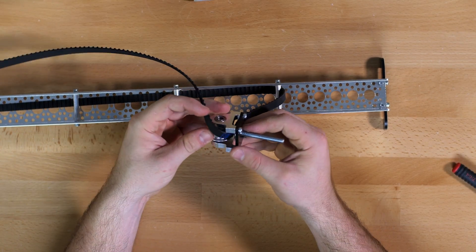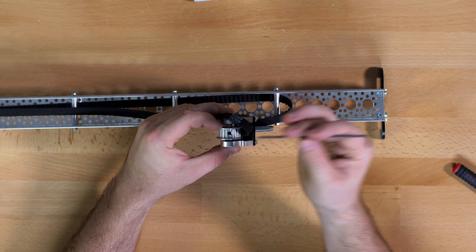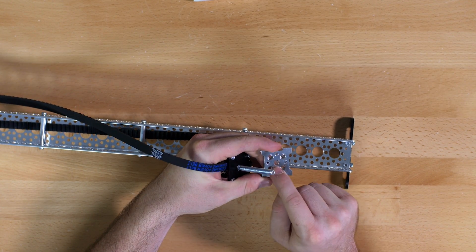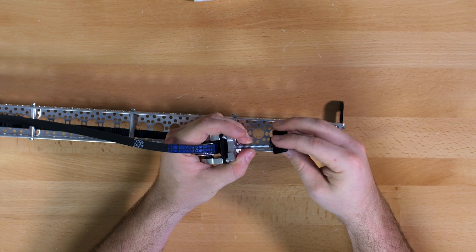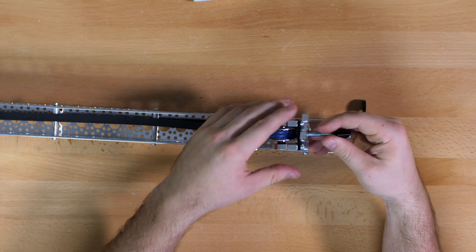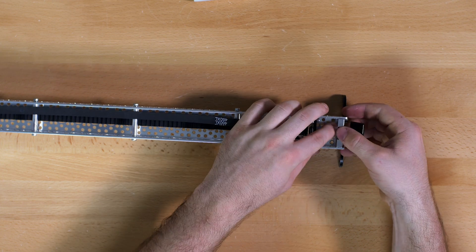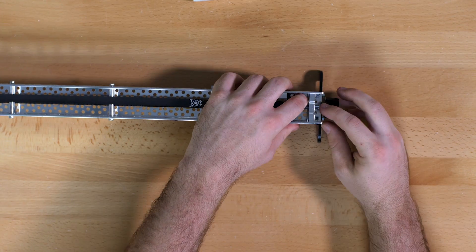Once that is on, find the middle for your pulley and fasten it in place, tightening it with the 3/32 inch hex key. Next, slide the quad hub mount — there is a side with a hex pattern and a side that is just a circle — put it so the hex pattern is facing towards the black square. Then attach the little belt tightener, putting it on just loosely for now to give yourself as much slack as possible. When that is together, it will all slide down into the middle of the channel, and the quad hub mount will bolt in there using your 5/16 inch screws.